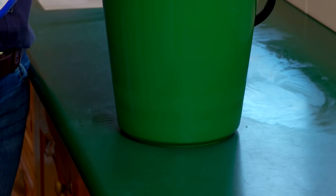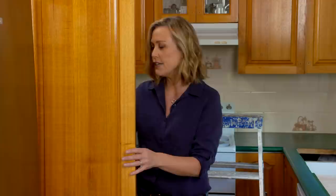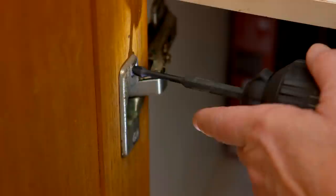Make sure to rinse it well. Trust me, cleaning is the most important step when you're going to paint your cupboards, bench tops, and tiles — otherwise your paint just won't stick properly. There is a tip when you remove cupboard doors: leave the hinges in place, and when you take the door off, make sure you number it.